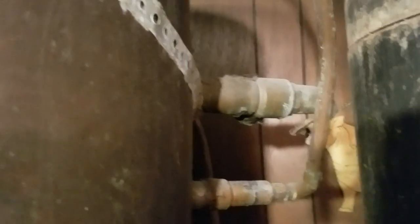Right up here is the hot line coming out of the tank. It's not at the top of the tank, so I had to get a little funky with that. Inside the tank there's actually an elbow that goes all the way up to the top. Over here there are two fittings, one inside another — I made this coaxial fitting so I could get water off the very top of the tank where it gets hot first. Above it is a temperature and pressure blow-off valve, which releases pressure if the system overheats and starts boiling.